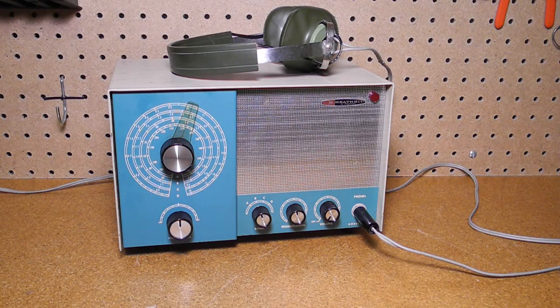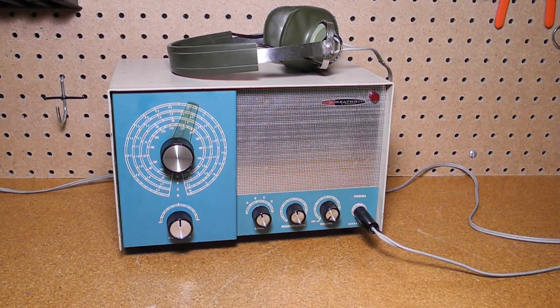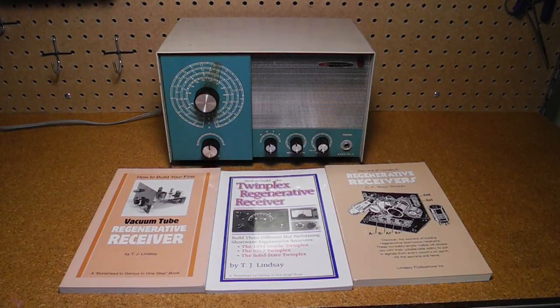In summary, the GR81 was a low-end, affordable radio billed as an economy model. Compared to regen receivers from other manufacturers, it was a little better for a number of reasons: it featured an isolation transformer for safety, the power circuit was fused and even has a holder for an extra fuse, it provided a fine-tuning control, two different antenna inputs, and a solid and quite nice-looking metal case. Compared with higher-end receivers, the radio is not very sensitive or selective, suffers from hum, and is tricky to adjust. Tuning is not very accurate. However, for $20 to $30, it was an affordable way for someone to get introduced to shortwave listening and the satisfaction of building a radio yourself. Many people started their interest in radio with this or a similar unit, later upgrading to more sophisticated and expensive equipment.